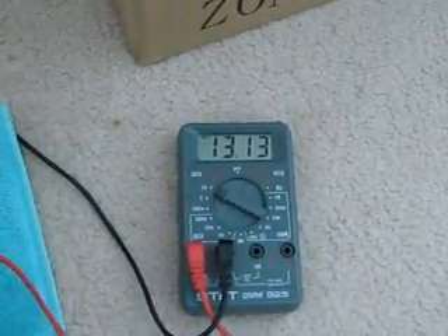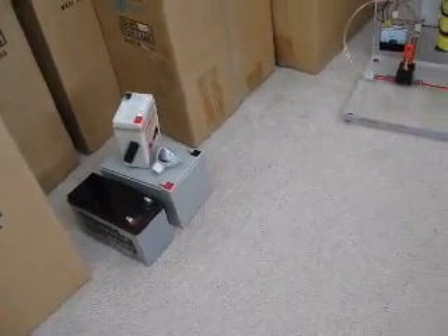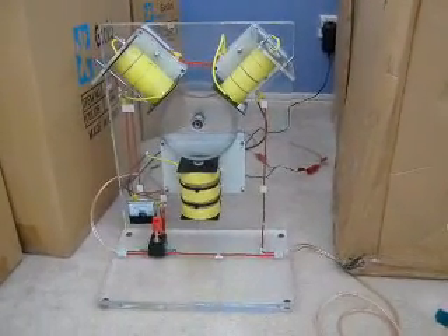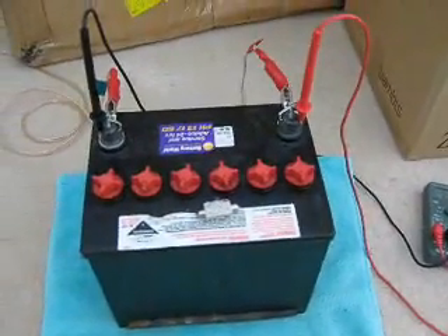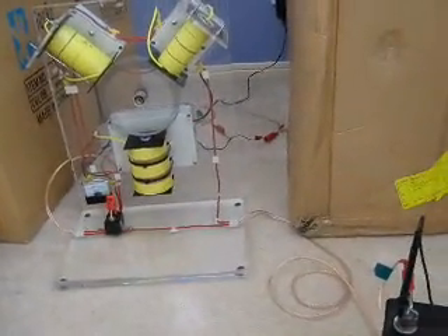That's it operating. It's already got the battery back up and it'll climb up to wherever it was charging before. There are a couple of little batteries I've been conditioning — there's a little six volt sealed lead acid one. Seems to work really well. There's been a huge increase in output — with just the two coils on there before I couldn't get this battery charged at all; it wouldn't go above 12 to 12 and a half volts. But straight away there's this huge improvement.